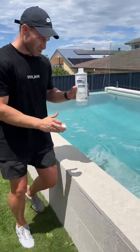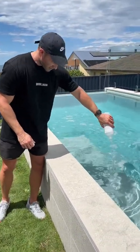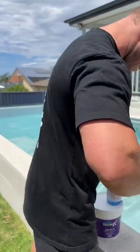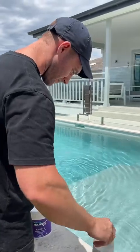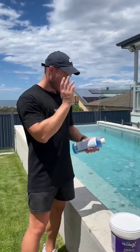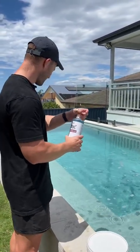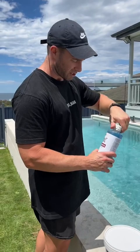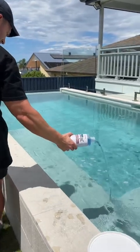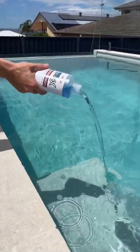When you're done with your bottle you can fill it up with some pool water, swish it around, and get that last bit out — every drop counts. Same thing with the phosphate remover — read the instructions, know your dose for your pool. These can go in next to each other, on top of each other — that's fine, they're not harmful or dangerous to your pool in that way. They are, however, dangerous and harmful to humans.